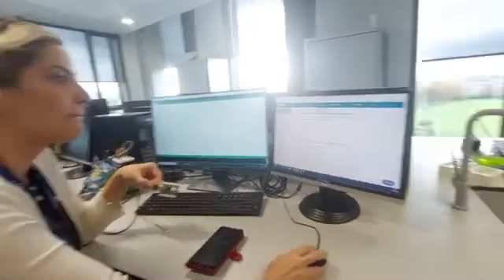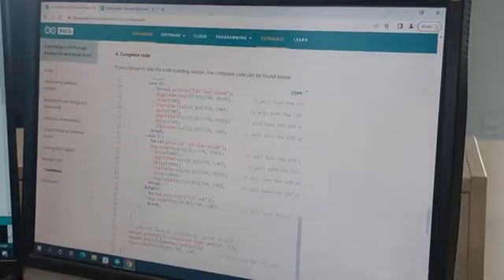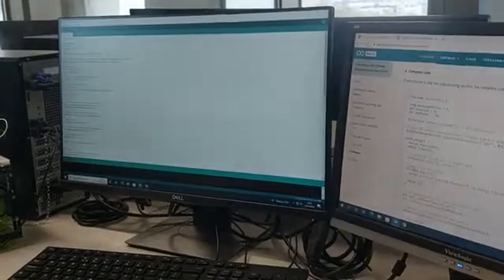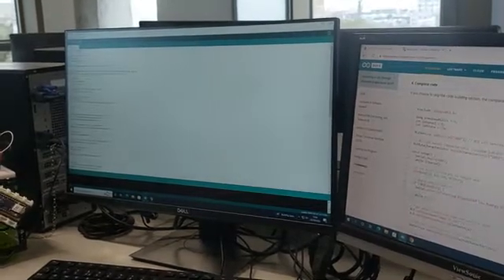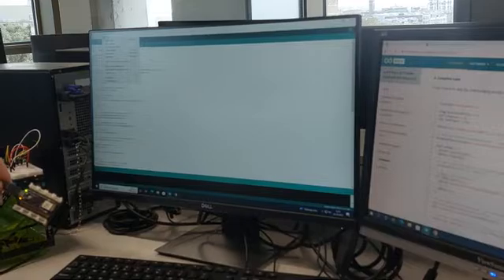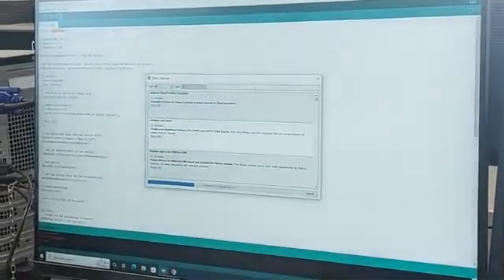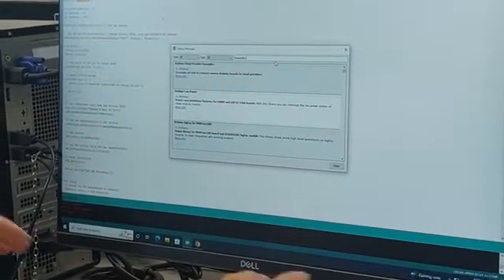Now I'm going back to the page I mentioned — there's a complete code here that will connect the Bluetooth to the LED. You can click copy and bring it into the IDE window. Before you compile or upload that to your Nano, you should install the ArduinoBLE library the same way we've done before, from Manage Libraries — just type the name and it comes up. Be careful of typos; it should be easy to find.